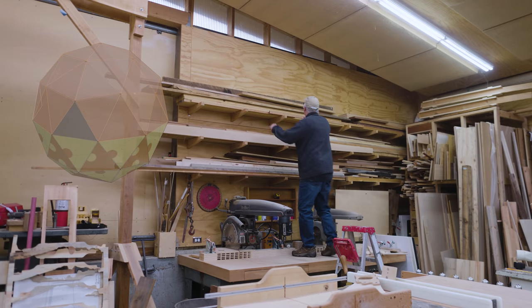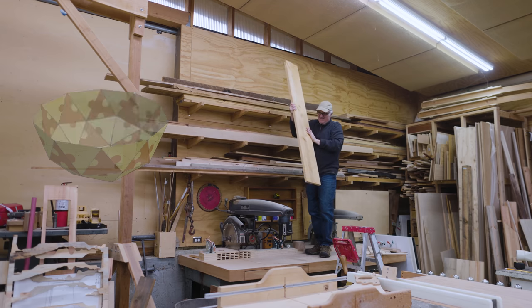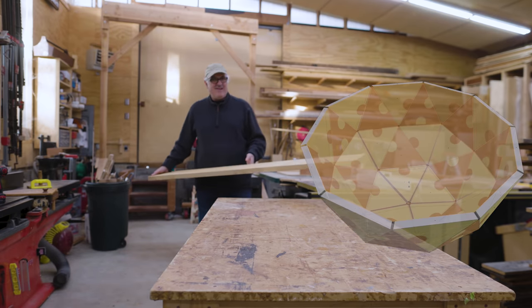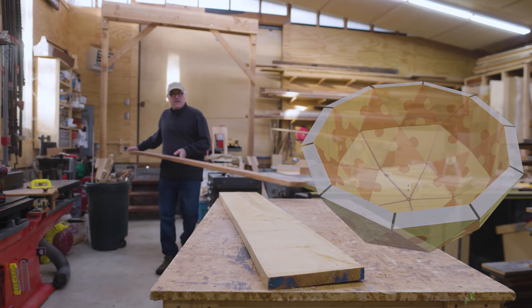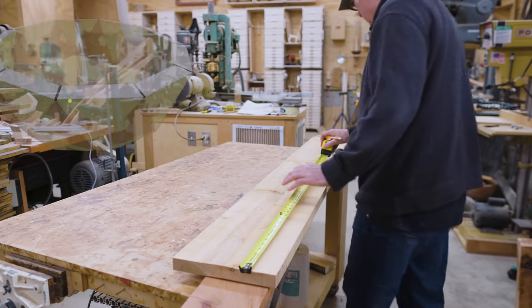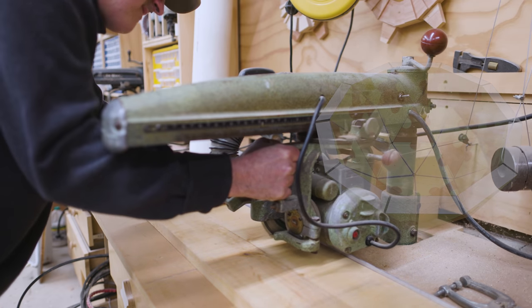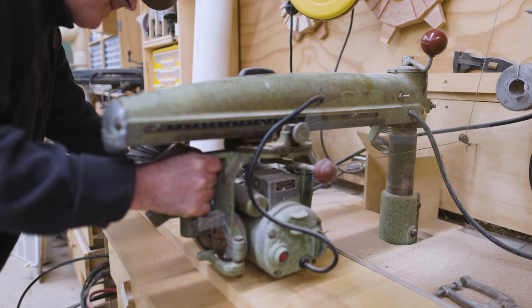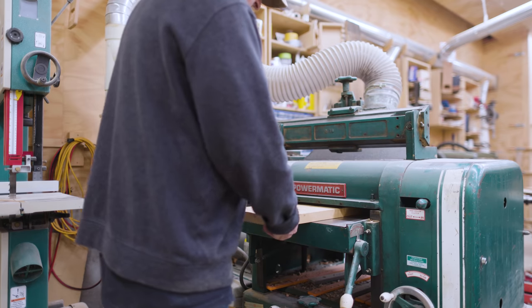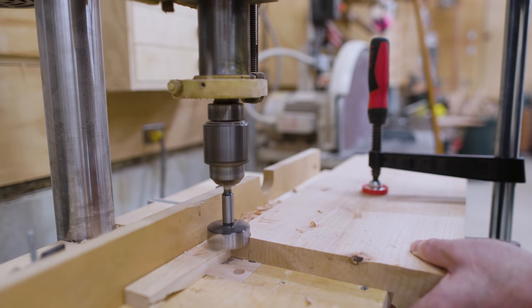In making the pattern, I was thinking about what kind of wood I wanted to use for the two different colors. My first thought was to just use walnut and maple, but I felt like I've been using that a lot recently. So I found a piece of cherry that I've had for a while — I think I got this as a bigger batch and this was a small piece from that batch. And I also found a piece of kaya that I think is left over from the kitchen. So I could joint and plane those pieces and get them to a similar thickness so I could start to make the parts for the triangles.